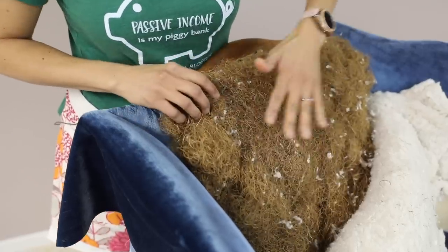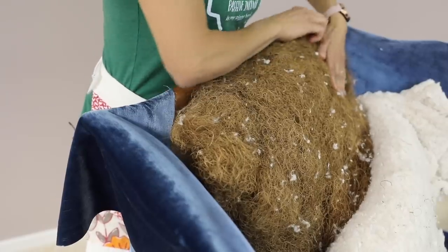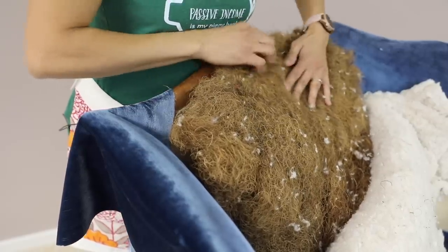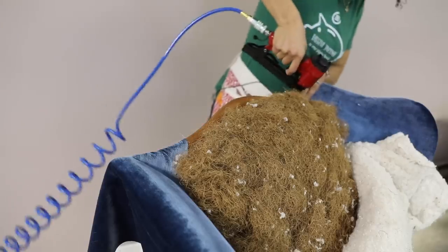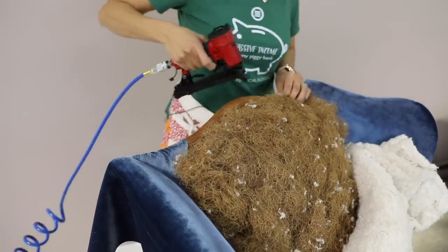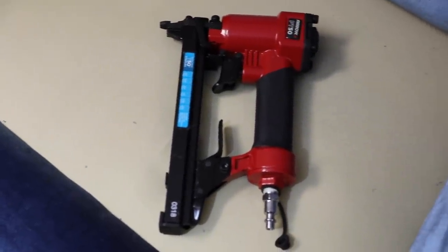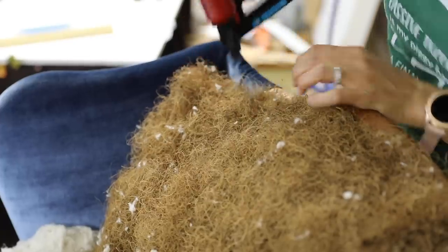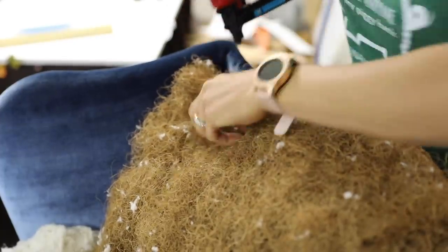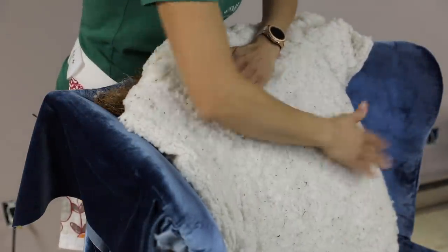Now, if you recall at the end of part eight — you can find that down below in the description — the coconut fiber had to go on first. This was important to make sure there was enough coconut fiber so when you push your hand on it, it wasn't clumped together and you couldn't feel the springs. I used my Arrow Fastener stapler, which I've teamed up with them for this video to test out their upholstery stapler, and I secured it to the edge. I'm pulling it up to the very edge so it lines up, not over the edge of the chair.